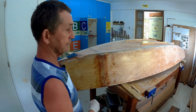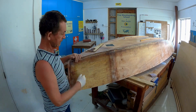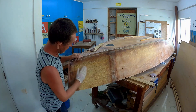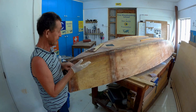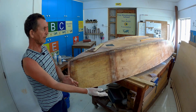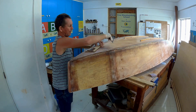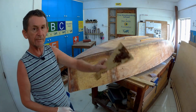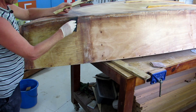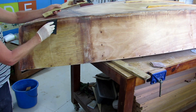We filled it all in like I showed you and then we sand it down. When you're sanding this down, because there are fiberglass hairs, you're not meant to sand down your fiberglass — that's your strength — but you will sand some of it, especially on the edges where you're fairing it in, especially when you're not using proper tape. You should wear long sleeves because you will get fiberglass dust, similar to insulation in an attic, which makes you very itchy. Now I'm going to do a second fairing — we'll put less sawdust in this one to get a finer finish, and this is our last fairing before we prime it.